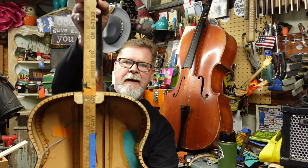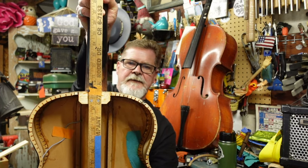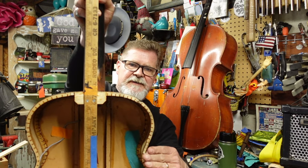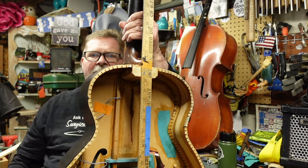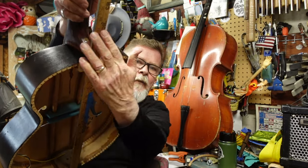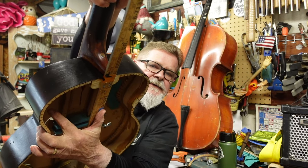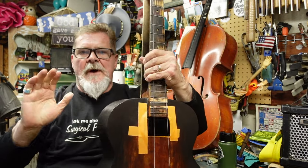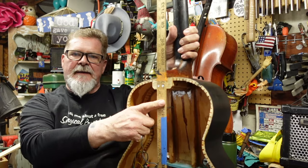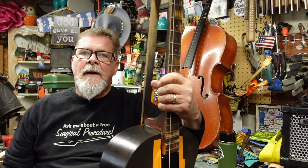So I want you to watch right here. I'm going to grab the neck. I'm going to hold the body. Pick a reference point. You see, things are twisting. They are twisting right here at the waist. Even though this has got this on here, watch this part right up here. You see, it's all flexing. So, in order to make this work, to get the back glued on, I have to take this off and I have to be able to keep tension on it while I'm doing it.